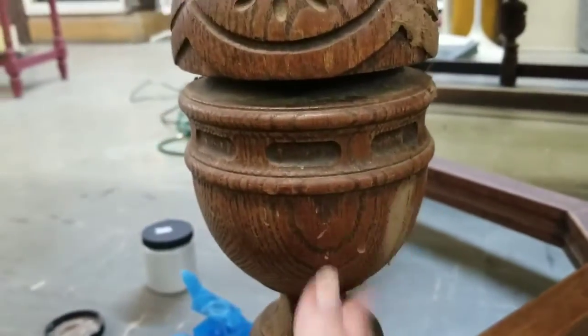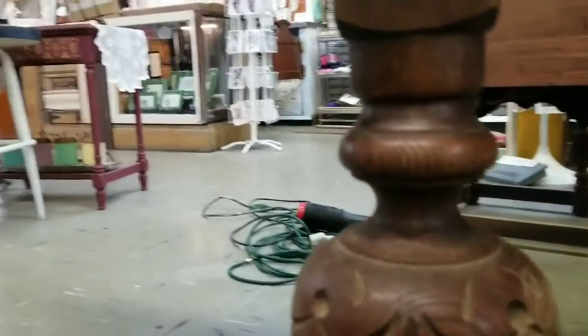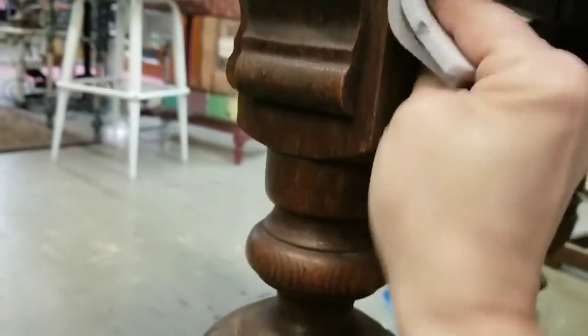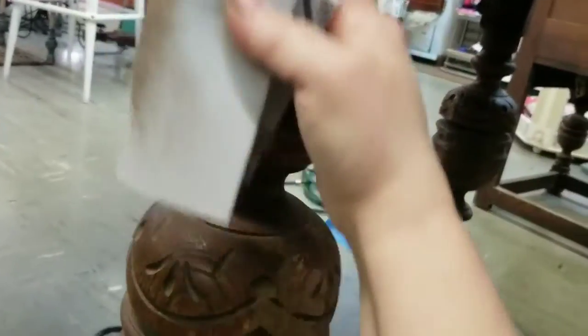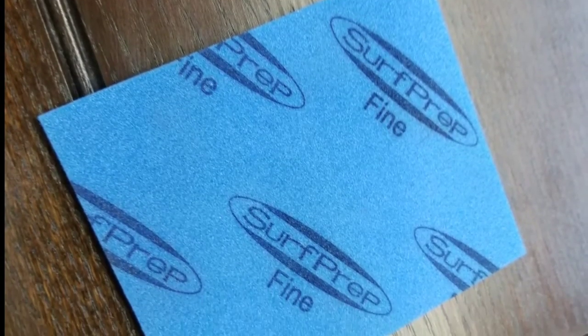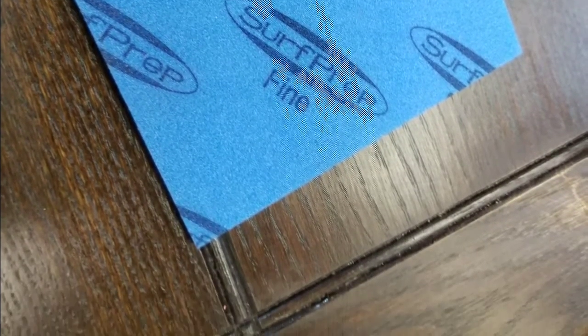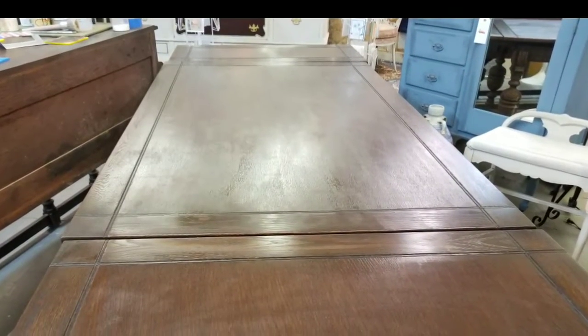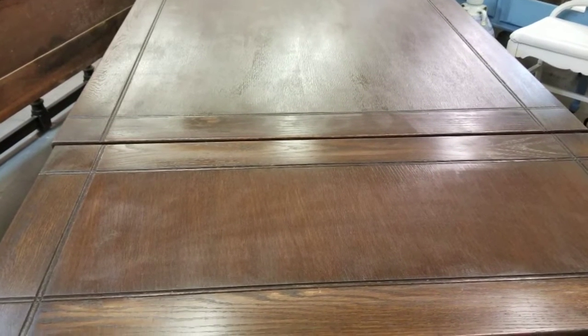Anywhere I found a crack I just filled it a little bit. Then I used a medium grit paper because the medium removes — and unlike the tabletop surface, I wasn't worrying about appearance on the base since I know I'm going to paint over it and I wanted to remove the glue residue from where the old decorative piece was. Looking at the tabletop, I didn't like those splotches, so I came back with medium sandpaper and then followed up with the fine grit to prepare the surface. I'm liking the surface better now and came back in with stain again — looking pretty good, but I'm going to let it sit.